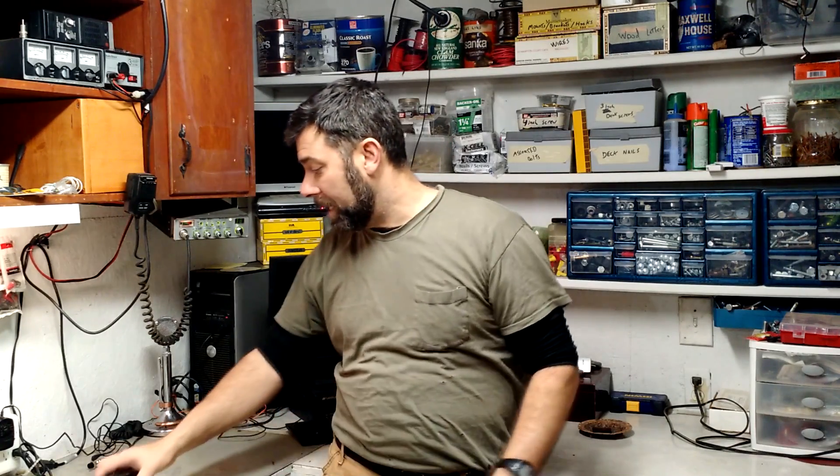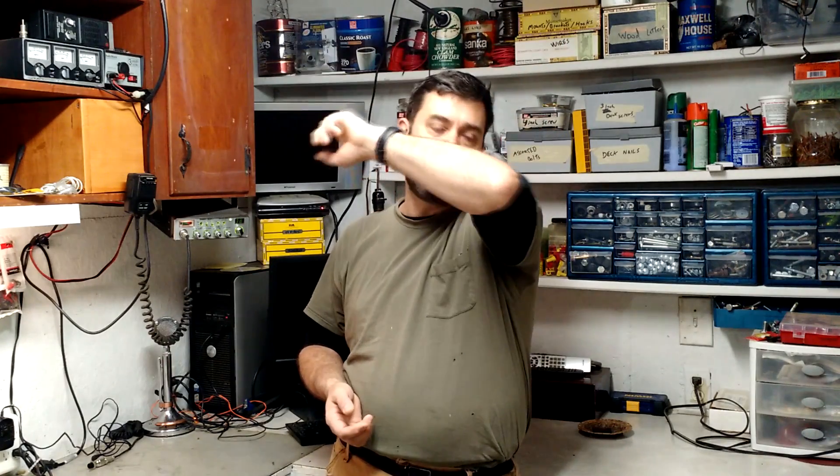Generally speaking, when you came across people that had dual antenna setups in their home, those antennas pretty much made up for the fact that they were losing a little dB in the setup, because these guys were real serious about this stuff. I would love to have one myself — I could put a four-antenna beam setup there, have a directional on an antenna rotor, turn it 360 degrees to find the groups I want, set it stationary on those, and then when I want to just listen for skip, flip the switch to the other side where my omnidirectional Antron is pulling signals in from all over the world.